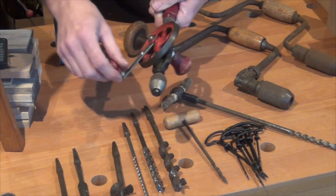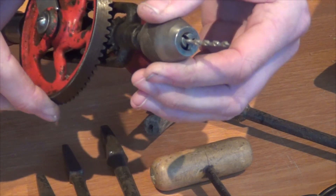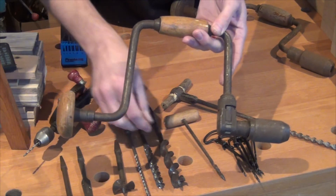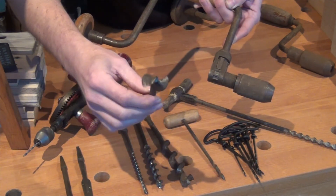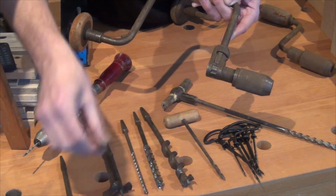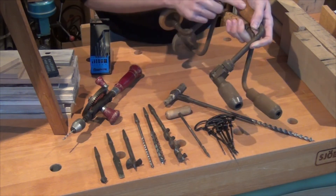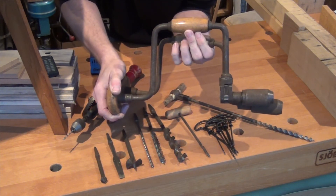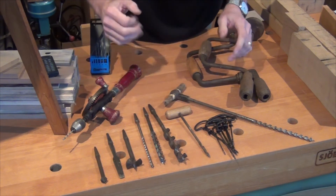The next one is the egg beater style drill. This one is a keyless chuck that takes standard twist drill bits, so you can still get bits for them very cheaply. And finally we have the brace. The brace is used with various bits, coming from the smaller end up to larger. You can get different bits for these braces as well — this one's like a Forstner bit, just for shallow larger holes. You can get screwdriver bits for them, and here's a countersink bit. If you're buying a brace, one thing to look out for is the throw, which is basically the distance from the power handle through to the line that the drill bit's in. One is about an inch wider throw than the other one. Obviously the wider the throw the more power you can get into the cut, but it also means you need a bigger circle and sometimes you just don't have the space.